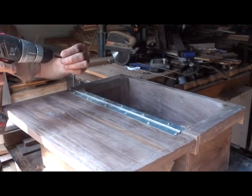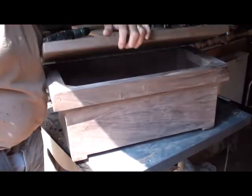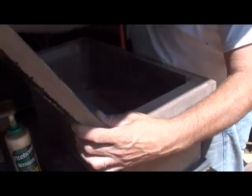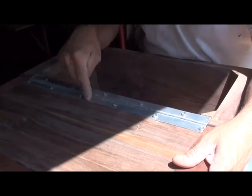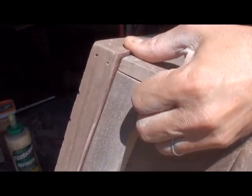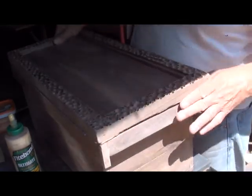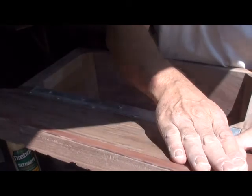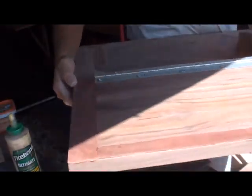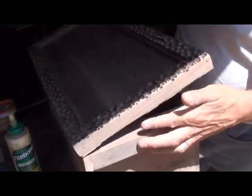You can see what I've done with the top — those little bubbles all the way around, I've sanded them down. Some have burn marks in them; I'm going to leave those for a unique flavor. There's the box. I accidentally put the lid on backwards, but I undid it, flipped it around. It's a little off on each side, just a smidgen, but it opens up nicely. To cover up the hinge holes, I put some contact cement on some leather I had laying around, which also accommodated the thickness of the hinge. It closes nicely and snugly with no gaps.